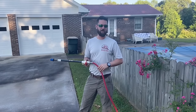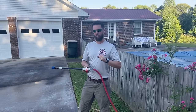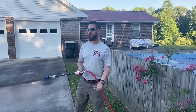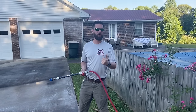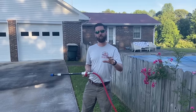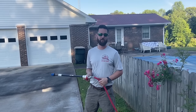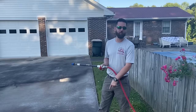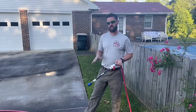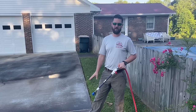We've got our soft wash system set up to apply about a 3 to 4% mixture down here on this pad. Something very important is PPE. When we're applying here, especially if it's really hot outside, we spray this pad and all that is vaporizing — we're breathing it in. Highly recommend you wear a respirator. Get a 3M respirator and make sure you keep those cartridges changed out — they're organic vapor filter cartridges. We recommend those for roof cleaning and driveway pre-treatments. Also, make sure you've got good waterproof footwear.